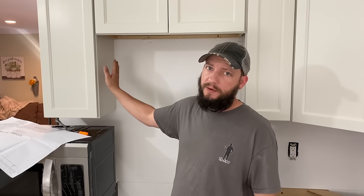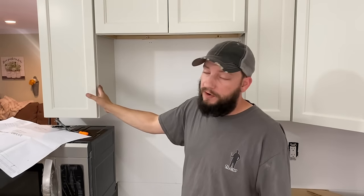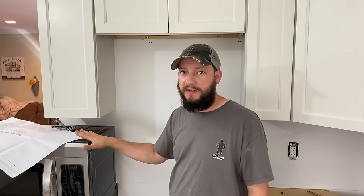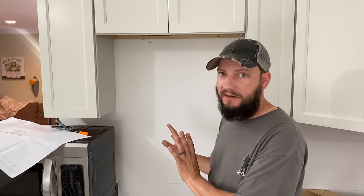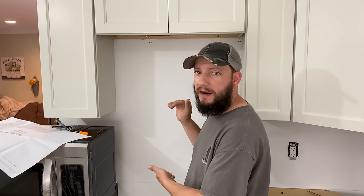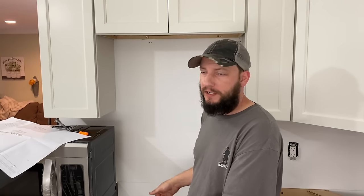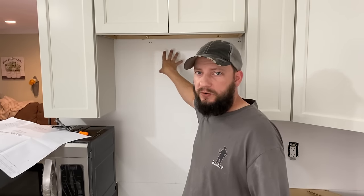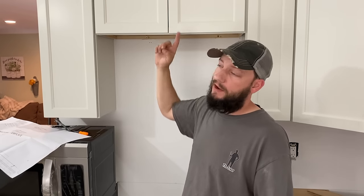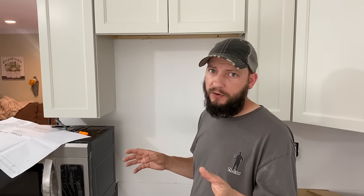Before you start your installation, make sure you have a minimum of 30 inches between the cabinets. This is a 30-inch cabinet, and I made sure to keep it plumb so that spacing is 30 inches. It's a pretty tight squeeze — like 29 and 15/16ths — so make sure you have the full 30 inches. Also check your local building codes: there's a minimum and maximum height requirement from the top of the stove. I'm venting right out the wall with an electric range, so check your codes to make sure what you're doing will work for your area.